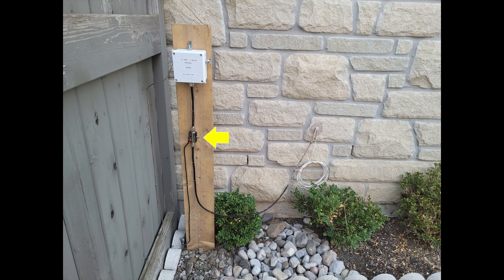This patch cord is to connect the lightning arrester to my transformer. The next step, I drove a 4-foot copper grounding rod near the fence board, then ran a grounding wire from the lightning arrester to the ground rod. The last step was to connect my RG-8X coax feed to the lightning arrester. The RG-8X coax was routed into the basement through a small hole, and that hole was sealed from the weather elements by an outdoor caulk.